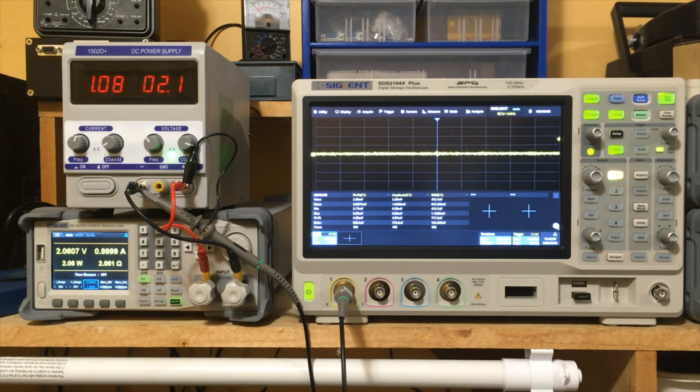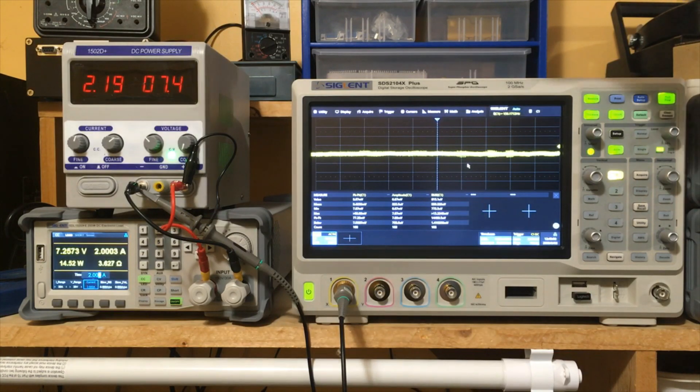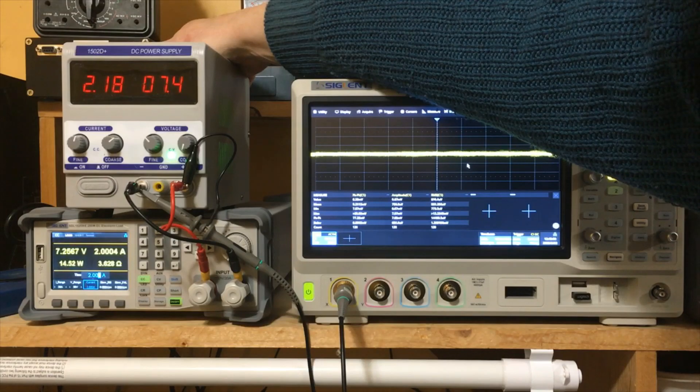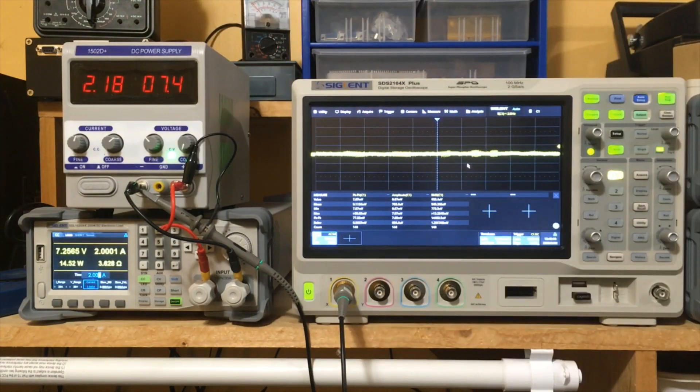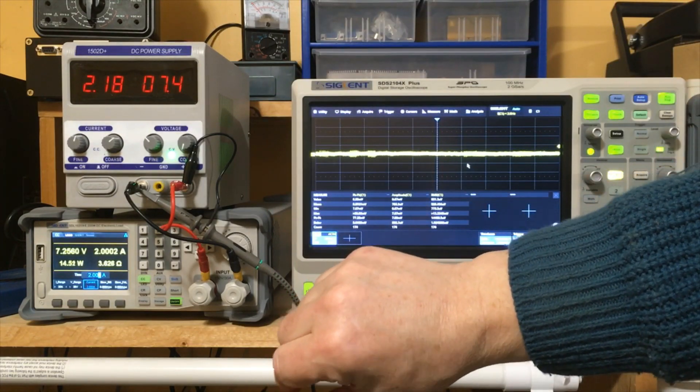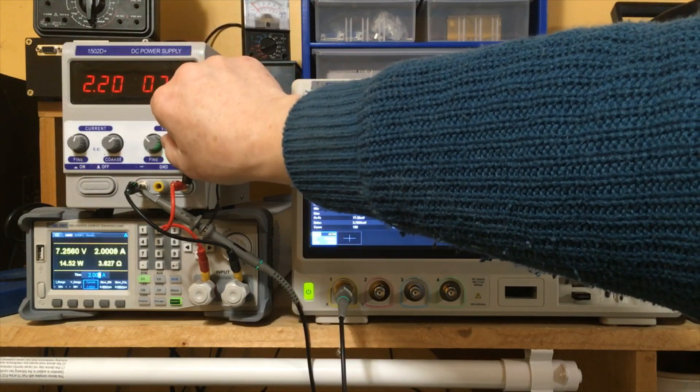Basically we're not seeing this power supply producing any noise whatsoever at half load. That's really good. We're right about 800 microvolts RMS, so not too bad considering we're running it pretty well flat out. Let's check the temperature at the back — oh yeah, she's getting toasty. You can barely keep your finger on the transistor right now. Let's quickly bring that down to two and a half volts.